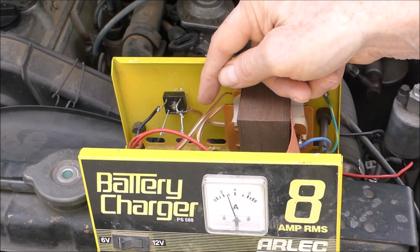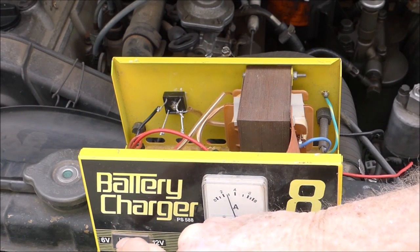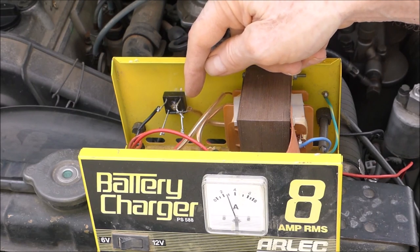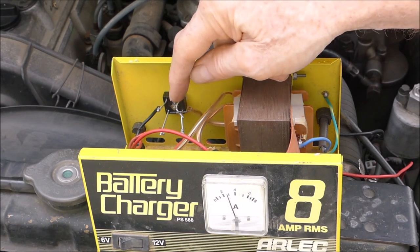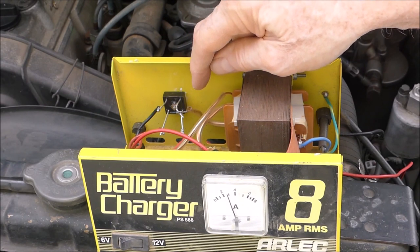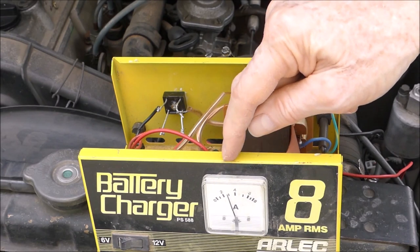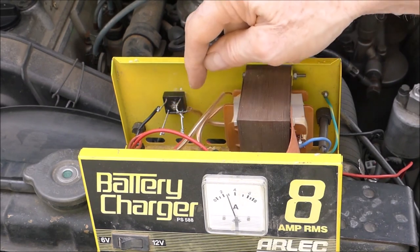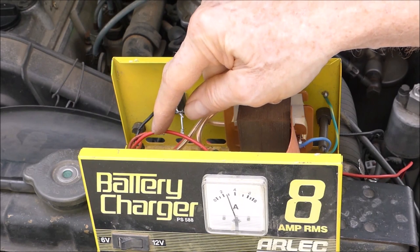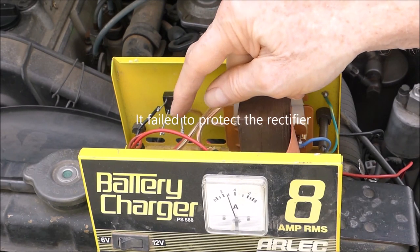What happens is the 6 volt and 12 volt outlets go to this front switch, and that then connects either of them independently to the center pole, which takes it back to the bridge rectifier. The bridge rectifier has four contacts — two are AC contacts and two are DC contacts. Two of those will go to your output: one will go through the amp meter so you can see the amps it's actually drawing, and the negative will go straight to the clamp. You may have a fuse on the positive line, or you may have a thermal cutout. This had a thermal cutout, but that was dodgy as well, so I did away with it.